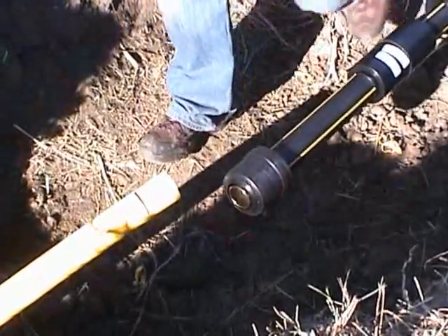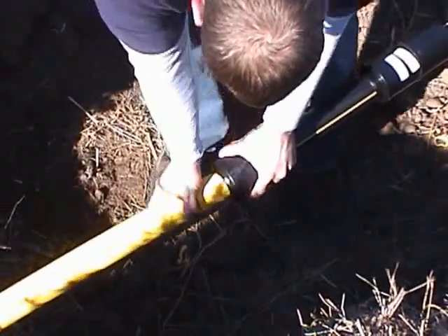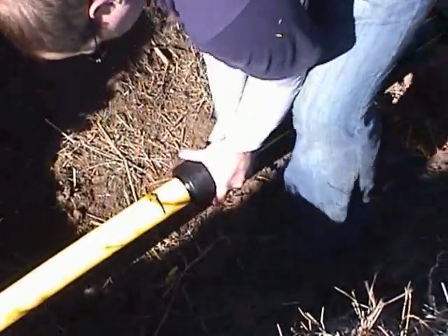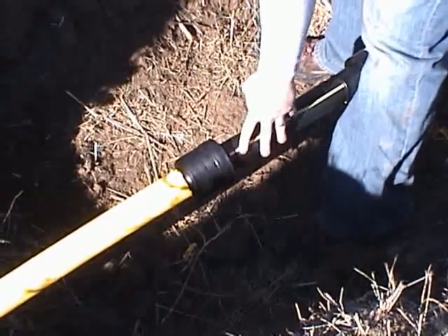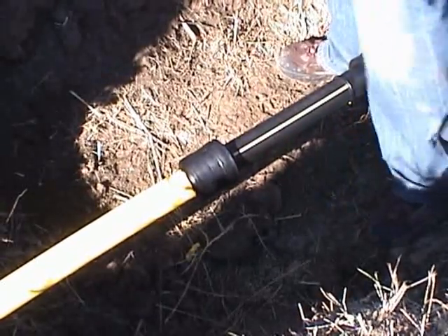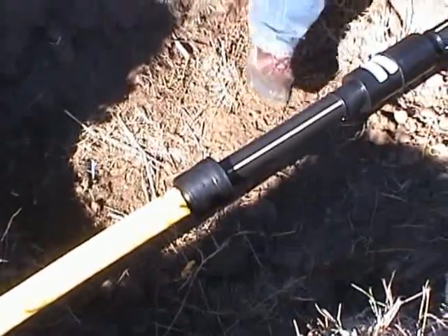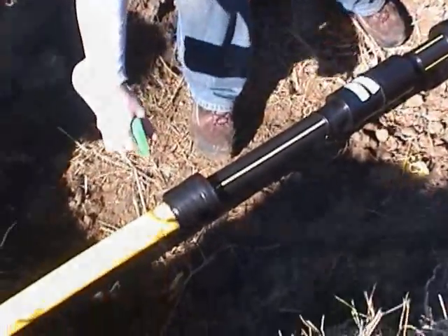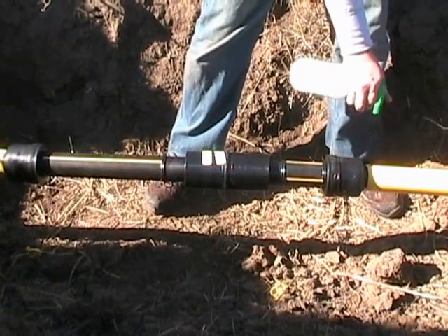Expand the scope as you install the constab onto the chamfered pipe. The stab mark should be within 1/8 inch from the entrance of the stab fitting. The repair scope has been installed. Each joint must be leak tested in accordance with your company's procedures.